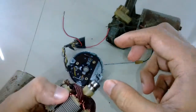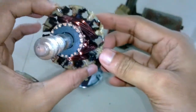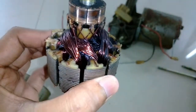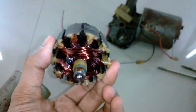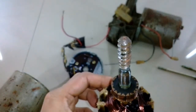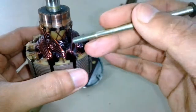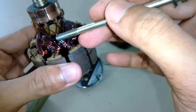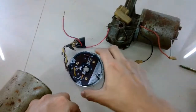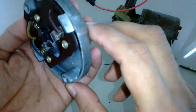All the grease and everything is dried up. The commutator is on the output shaft in the front, and behind that is just the shaft which goes inside the bush. The coils look burned — the plastic insulation is almost melting and the coils inside are black, so maybe they are completely burned. But the motor was still running, so I'm assuming they are burned but not shorted out — and that's why they were operating. This proves these motors were used very heavily.